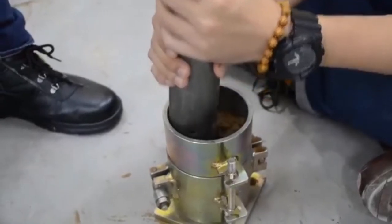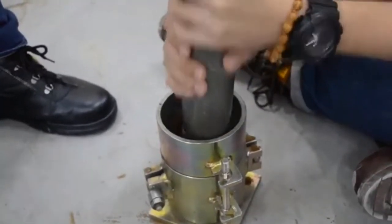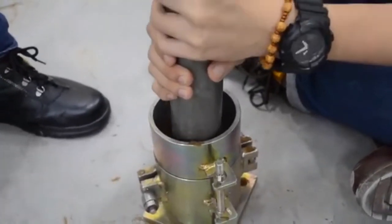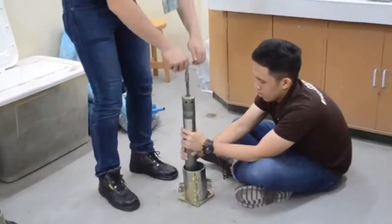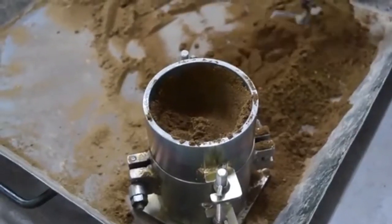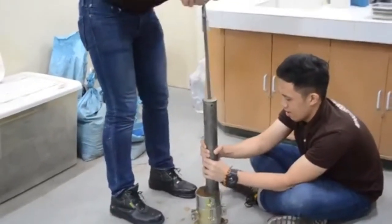In operating the manual rammer, take care to avoid lifting the guide sleeve during the rammer upstroke. Hold the guide sleeve steady and within 5 degrees of vertical. Apply the blows at a uniform rate of approximately 25 blows per minute, and in such a manner as to provide complete, uniform coverage of the specimen surface. Lastly, with soil of greater moisture content, repeat the addition of soil to fill the final layer.